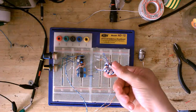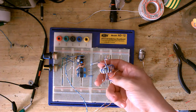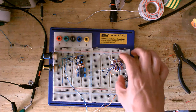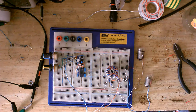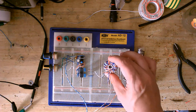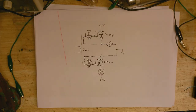I've gone and made a gate drive transformer. I got the core out of one of those mains filter chokes — they seem to make pretty good transformer cores. You can see there are four windings with eight wires coming out. Each winding is about 12 turns each. I'm going to plug this in and see what kind of output we get.